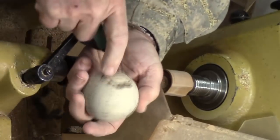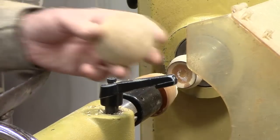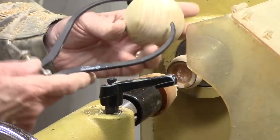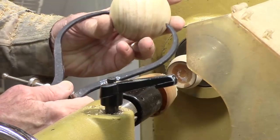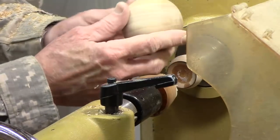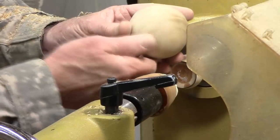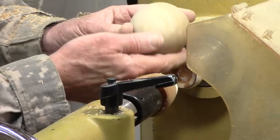Got some bug holes, but that just adds a little character. How much did we lose by turning and twisting and trying to knock the edges off? Here's the original caliper setting and I would guesstimate we lost perhaps an eighth of an inch. Not too shabby. I've sanded it to 150 and it looks like I've got a pretty good surface. I'll probably get up to about 220 and then call it quits before I dye it.